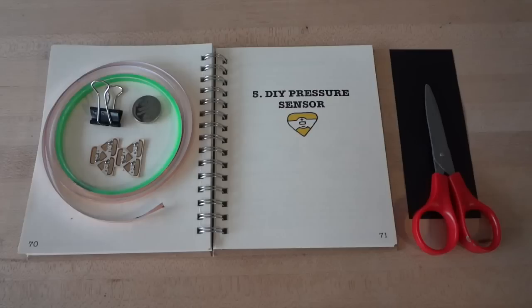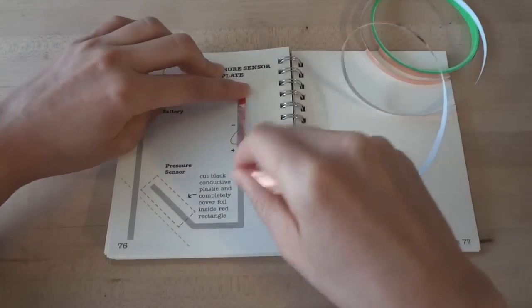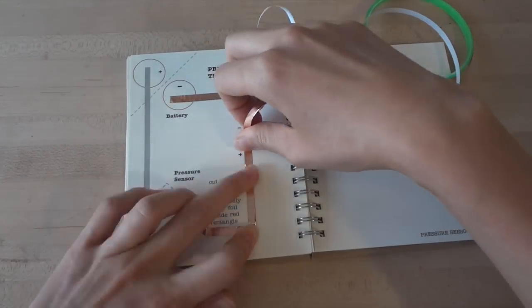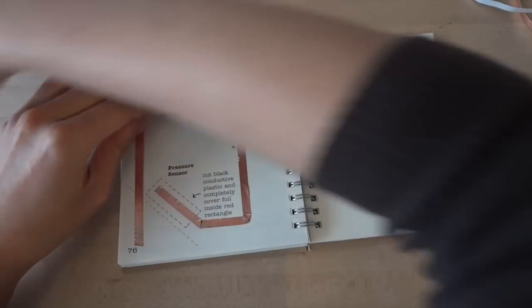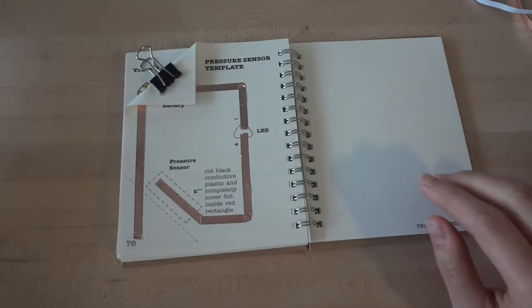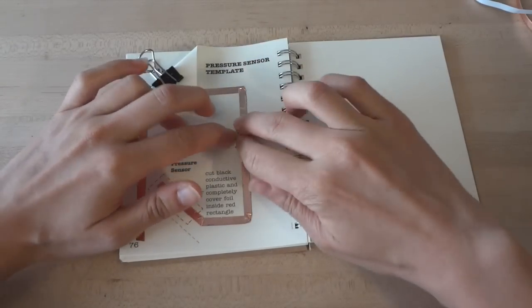For this tutorial, you will need the pressure-sensitive plastic sheet, one LED circuit sticker, a coin cell battery, a binder clip, conductive foil tape, and scissors. First, stick conductive foil tape over the gray lines on your template — remember to use continuous pieces of tape for each gray line, and to fold at the turns. Watch your fingers as the tape can be sharp. Next, fold the upper left corner of your page to create a battery holder, and clip your battery in plus side up. Now stick the LED sticker over the footprint in your template, and press down on the metal pads to ensure good connection.